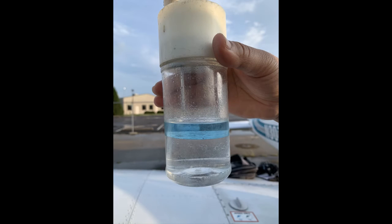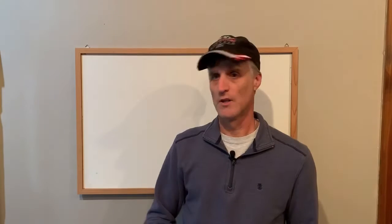Who knows — I seriously doubt that much rainwater could have gotten in during a refueling. If anybody else has encountered that, please put it in the comments. Finally, he took a sample and we got some fuel in it. You can look at this picture and see water settled to the bottom and fuel on the top. We dumped that, took another sample just to make sure, and it was all 100LL.